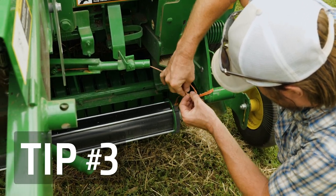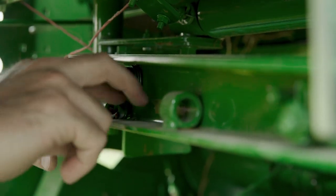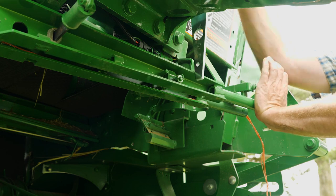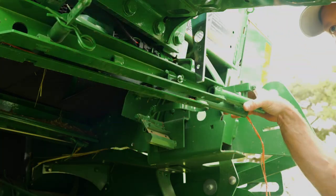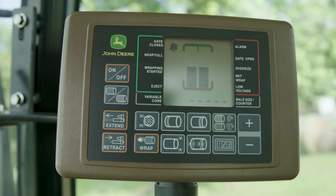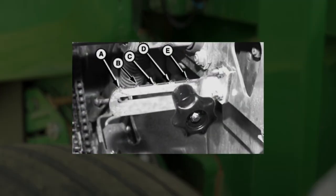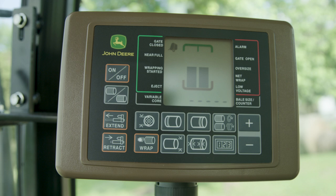Then repeat the exact same process on the other side of the baler. Once the second side of twine has been threaded and tied off, replace the spring pin that sets the twine wrap spacing at 2, 4, 6, or 8 inches wide — which should correspond to how you set it up on your end cap bale monitor, if you're using one. Set the number of twine end wraps on the monitor, then adjust the mechanical twine guide control to set the wrap distance from the left-hand edge of the bale. For most baling conditions, this should be set at 4.5 inches from the end of the bale. Be sure to also follow the instructions in your operator's manual for setting this on the monitor, if you're using one.